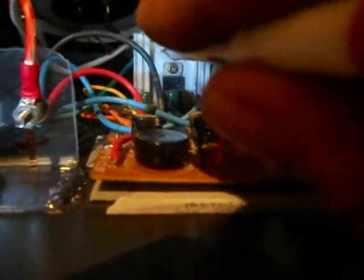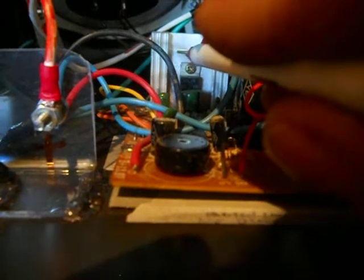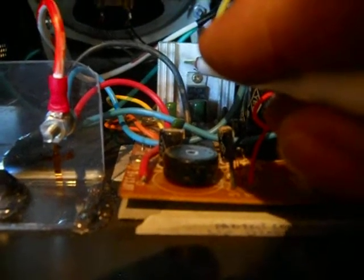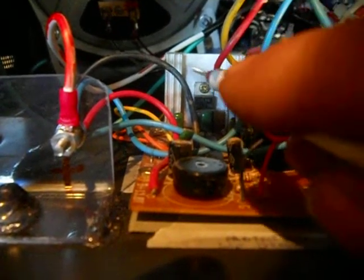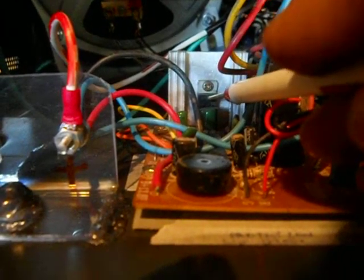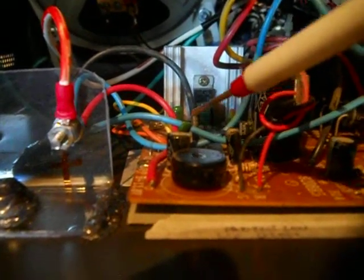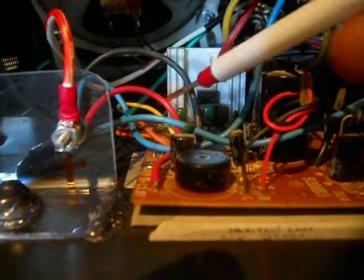This back here is your voltage regulator final. This is what that BR on the board — that knob I put on the front — it's between the positive and ground terminals. You can see it in the other videos. There's not a knob on it; it has a screwdriver slot. I may never put a knob on it. This is your actual voltage regulator where you adjust it. That's what that pot's going to do — you just put it on the board, extend it, and put the knob on it.